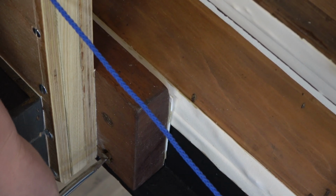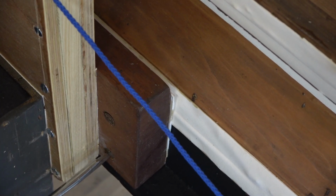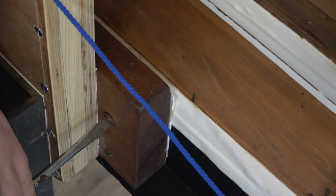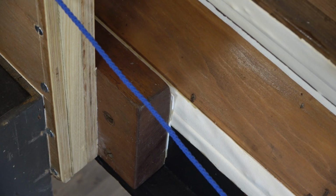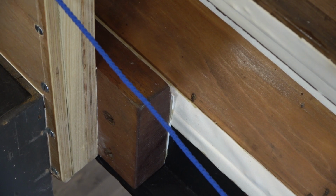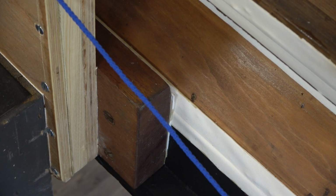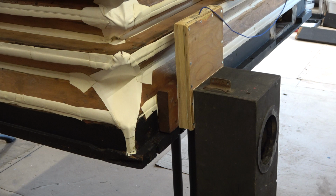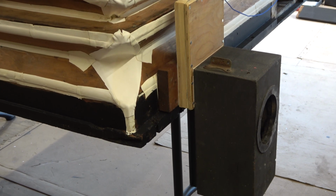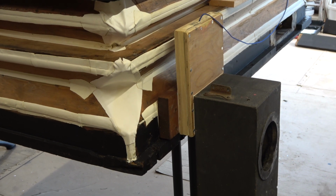So we're now going to put this on the bellows, because we're rigging it up on the work table rather than putting it in the building frame. We're going to be connecting the blower up with this control valve on the work table. As soon as the inverter arrives, we're going to be able to put the blower on and make sure there's no wind leaks on the bellows, because there'd be nothing worse than putting it against that back wall and discovering that there's wind leaks. So we need to be mindful of that and make sure the thing's going to be working properly. The next thing, I'm going to put this on with three original screws and one brand new one.